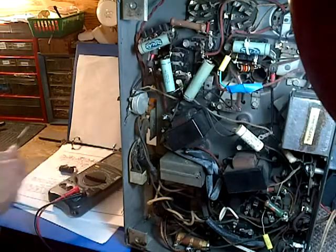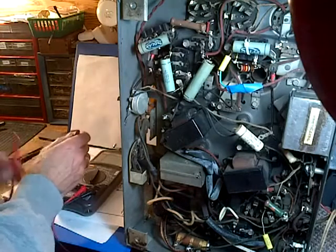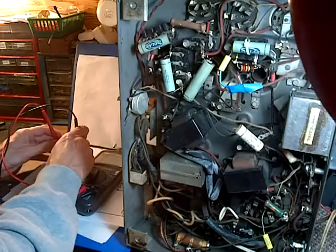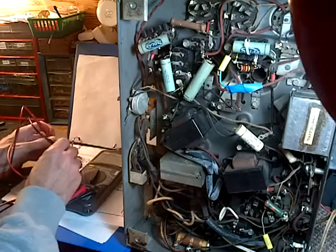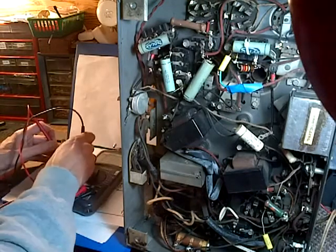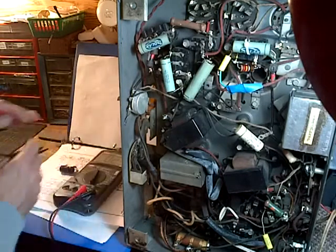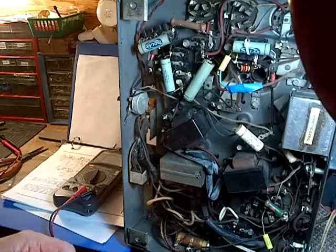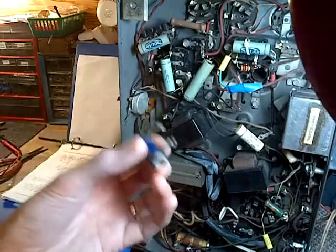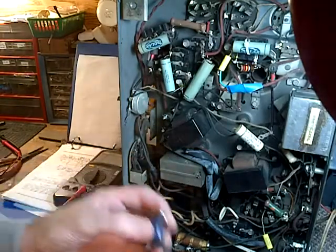Okay. So let's see what we got on this guy here. I think it should be around 2,000 to match the circuit. Yeah, it's 230 ohms. I would consider that small, considering what I know about the circuit so far. But you know what? This is right in the range of the resistance of the coil. The coil is just a little higher, if I remember right.